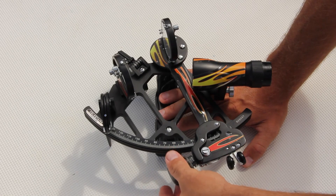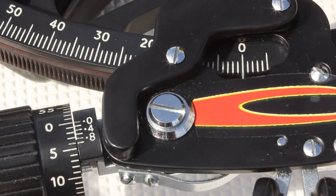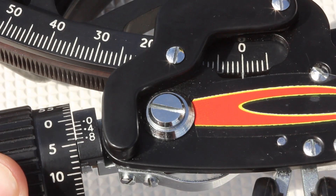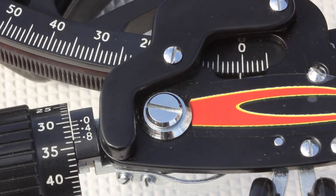Let's take a closer look at how to read the sextant. This sextant is set to zero degrees and zero decimal zero minutes. Note that zero is not all the way back on the sextant. A very small adjustment gets the sextant to zero degrees and 1.0 minutes. One minute of arc on the sextant equates to one mile of accuracy and measurement on a chart. This is zero degrees and 30.0 minutes — note that the degree reading is noticeably not zero anymore.